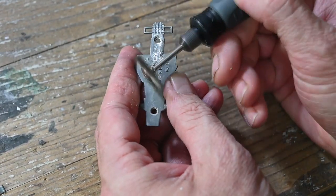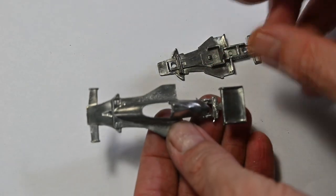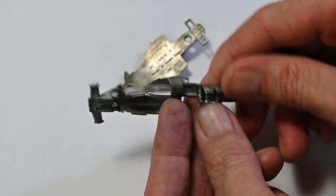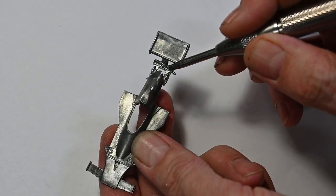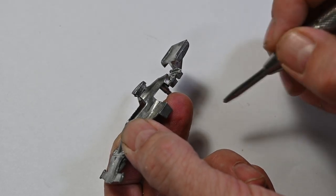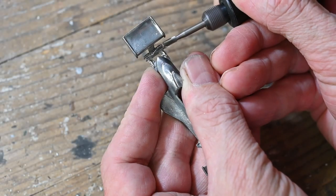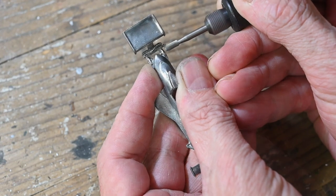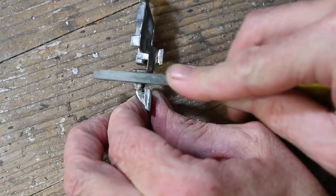And also giving the base a clean up as well. It was never painted. It's got plenty of oxidation on it. So here's the castings looking all nice and clean and shiny. Here at the rear, you can see where it's missing the little spaces to keep the wheels from flopping around. They were just a couple of little loops. So I'll remove the bulk of the remainder of them with a tool on my Dremel and then smooth off the area with a file here.